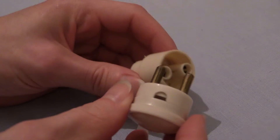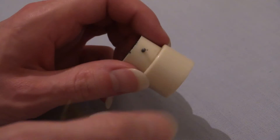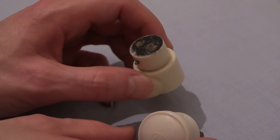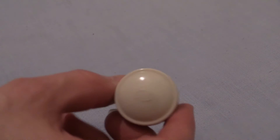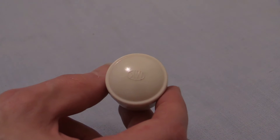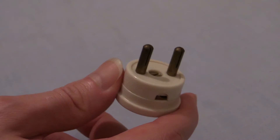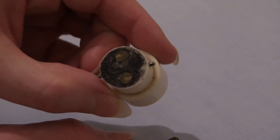As predicted, that's a little bit snug - okay, I've removed it. So we've got a shaver plug and you can put that in there and connect your shaver into light sockets. Other methods of connecting into a light fitting included an electric iron. Keeping in mind that electric irons years ago wouldn't have been earthed - they would have been about 300 watts or something. You could wire your electric iron in there, and that would have given you a variety of options. You could plug that in there and put that into the light socket.